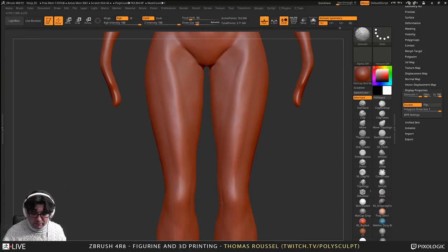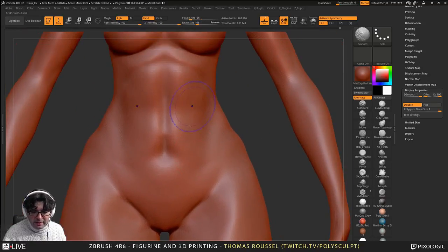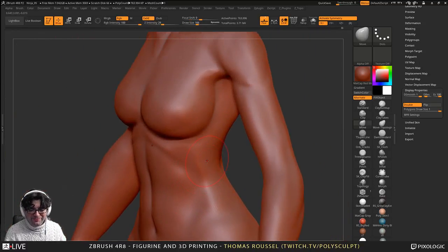where you have some irregularities, which is something very important to consider, because when you do your 3D print, all this kind of imperfection will be visible if you have an accurate printer, which is what I'm using. I'm using the Form 2. I have another printer, a Slash Plus, which is also an SLA printer but using a screen to print. The Slash Plus is 75 microns for the horizontal resolution and can go up to 10 microns for each layer. I'm not using this printer at this resolution, but you can be very accurate.